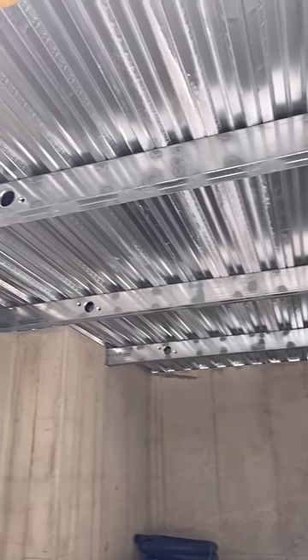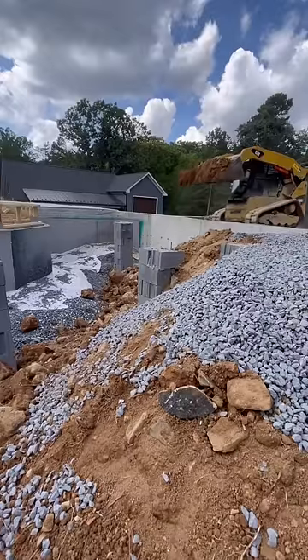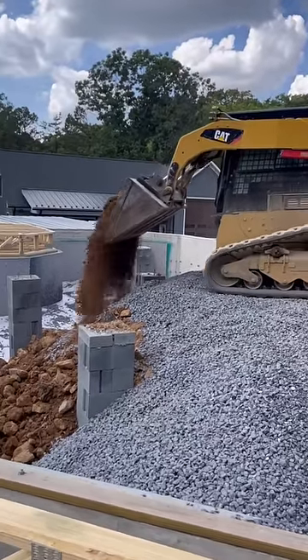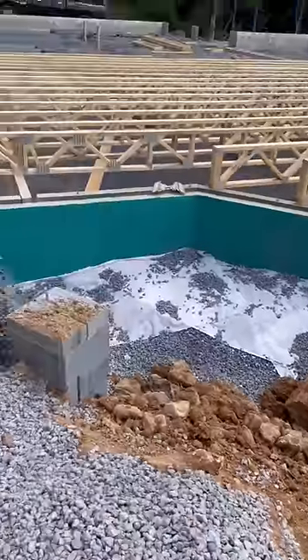Once we got our metwood beam set and the metal decking installed, we moved to the other end of the porch. This area was engineered for non-structural fill. This dirt doesn't need to be compacted — it only holds the concrete in place until it hardens. Then it will be suspended by grade beams over piers.